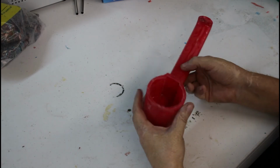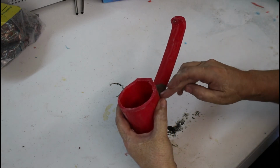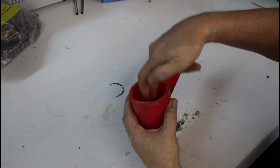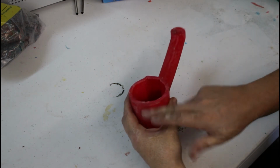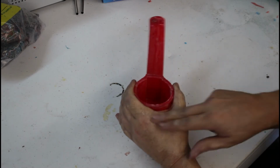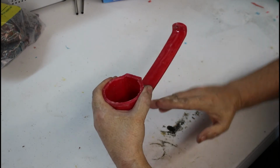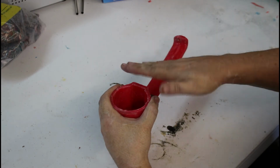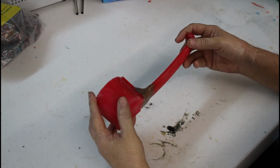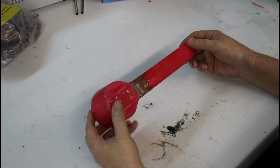So what it's going to require is building a mold and splitting this along this edge, curving and then going along this, coming across and dropping off into there, but not around the outside. So it's going to be a two-level mold. One level will be up where my thumb and finger is, the other level will be down here, with a shape like that. And then of course the corresponding piece will be the top of that. So it's going to be a little extra work molding it as versus a lot of objects that are pretty simple, but it's just part of the deal.